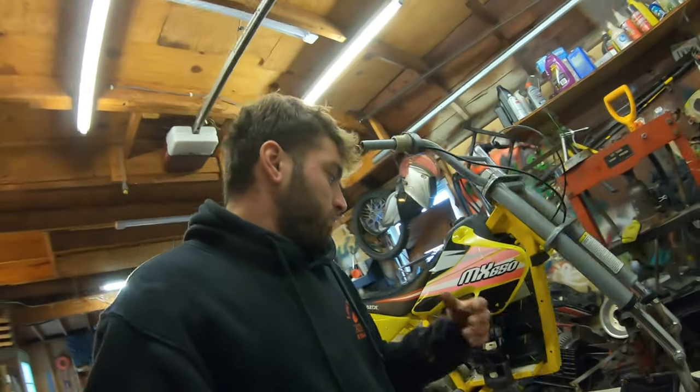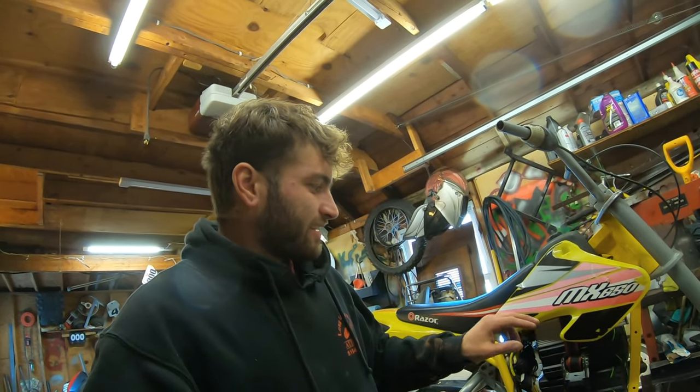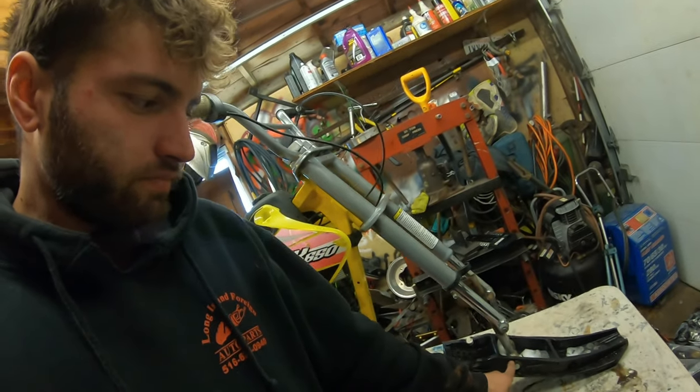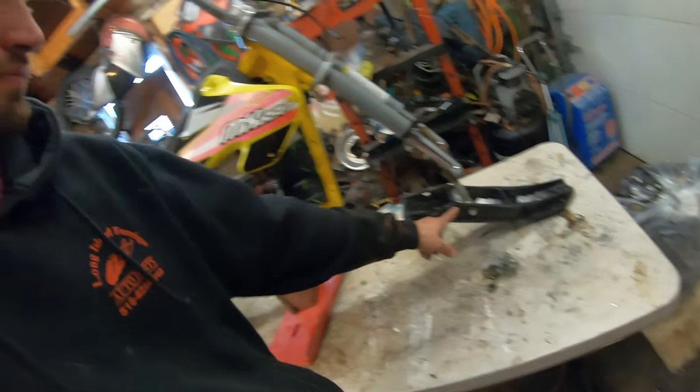We're gonna do bigger batteries, a sealed battery box, a new controller from Electron Company, and we're probably gonna have to modify this chain because this number 25 chain is probably not gonna hold up to all that extra power, but we'll find out then. So with that being said, oh, I also gotta change the front. We gotta remount that to over here somewhere. That's not a good spot for it.